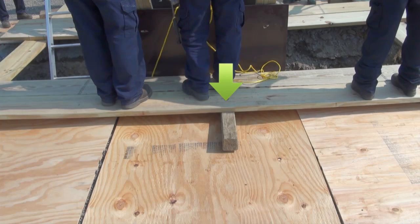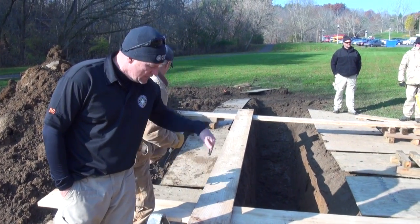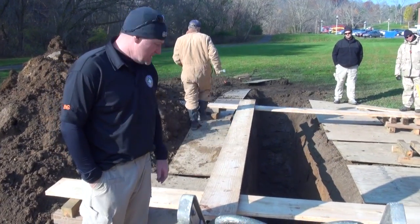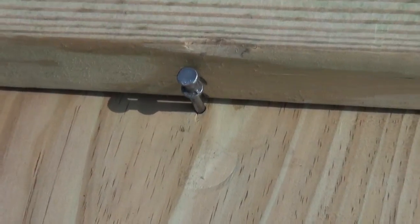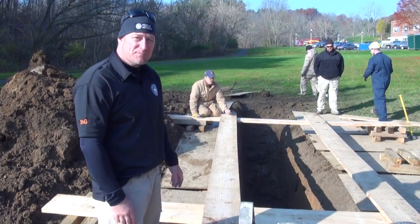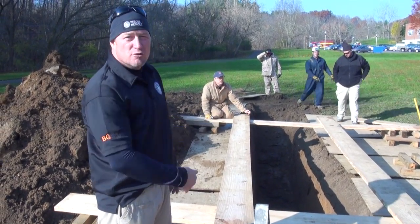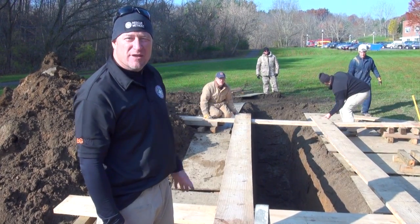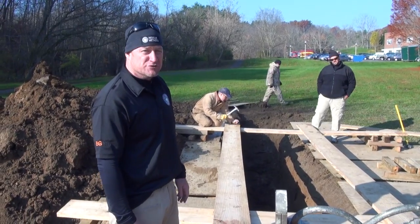When your parallels come in, it's imperative that the inside edge of the parallel lines up with the bottom corner of the trench. Once in position, you can drive nails. If you're using corrugated aluminum, you can lash them or pre-drill holes for nails to interlock this template, creating an overall framework for straight and true panel sets so that your system stays within engineering design and won't fail if you have a slough or load intrusion.